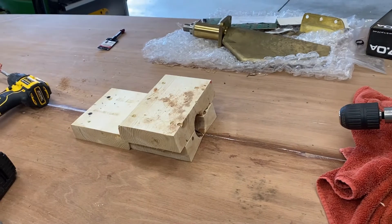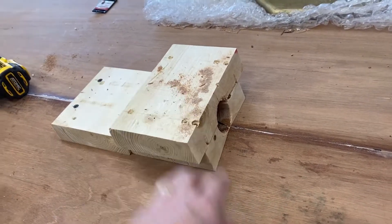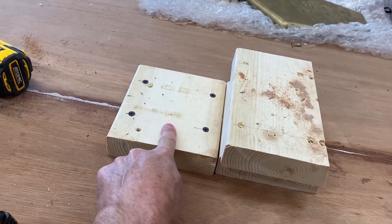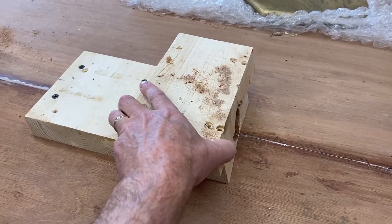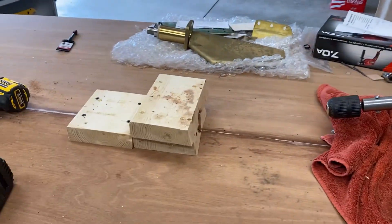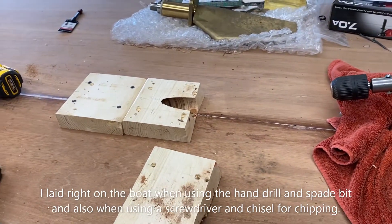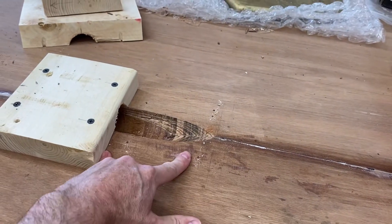I want to explain a little bit more about drilling the prop shaft hole. I have guide blocks - obviously not attached right now. I had this pair here but they were not wide enough - as I was drilling, the hole saw was coming out the back side, so I had to make another block to extend this. That actually turned out really well, because once I got far enough down into here I can take these off. What happens is you drill with a hole saw and then you've got to chip the plug out. I've been trying to use spade bits and a hand chisel to chip away - it's quite a pain. The nice thing about using a hole saw is you don't have to worry about drift like you do with a Forstner bit.